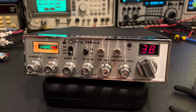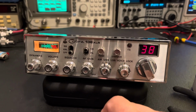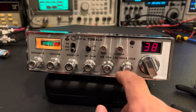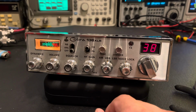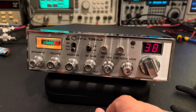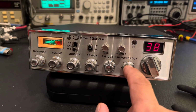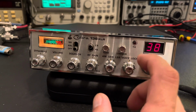So I'm going to go ahead and put that back to stock, and the radio is going to get recapped for sure. But other than that, output power is decent. Looks like most of the service bulletins on this radio have been done already, probably early on, and it's clean. Sideband linearity probably needs a little help. So I'll probably make a second video when I get around to recapping it, and then we'll walk through its performance after the recap's done. But right now it performs great.